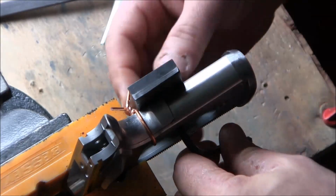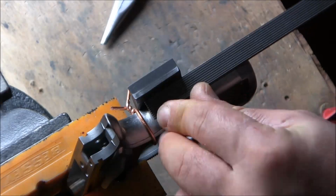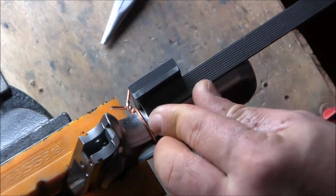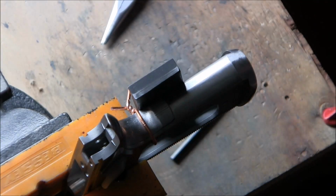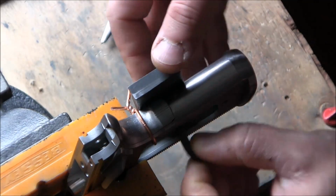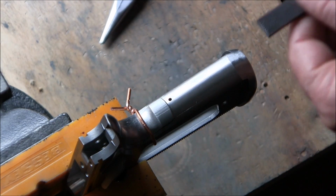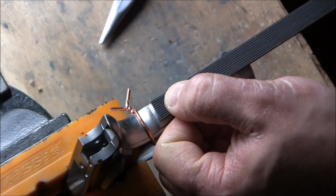Oh. So my jig wasn't as tight as it needed to be. I tightened it up and started checkering. And I think you've seen it before, where when you just start cutting those first couple of lines, that's really all you get. And in reality, that's all you need to take the jig off and continue cutting those lines using the first two as a guide. And now I'm going to try and actually make it pass just using those lines as a guide.